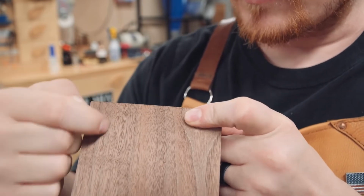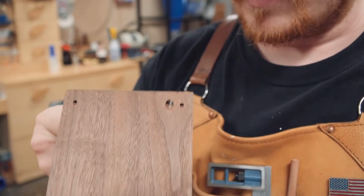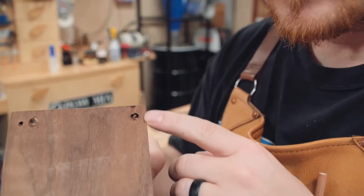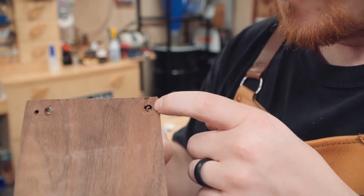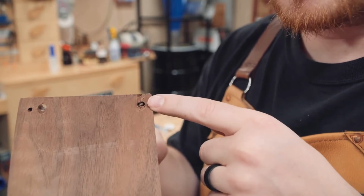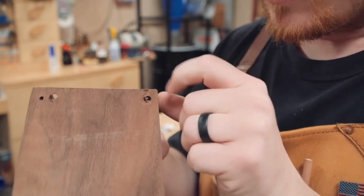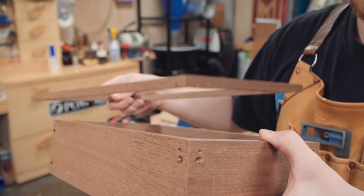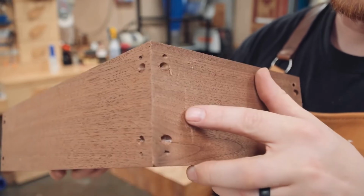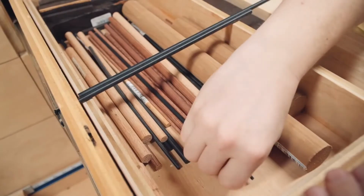because I need to cut the entire top off. I need to reduce this whole thing in the height direction. I goofed up, right? That's supposed to be a small hole, and apparently my jig wasn't set properly. The stop block wasn't set, or it slipped, and I goofed up completely. I went ahead and cut the top off like I said I was going to, and then finished all the cuts. So there we go, symmetry. And now we're ready for dowels.